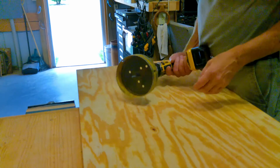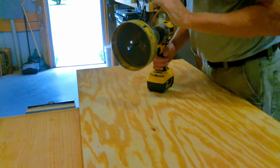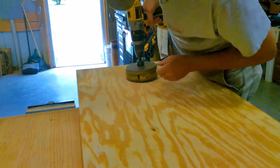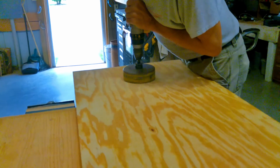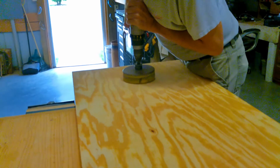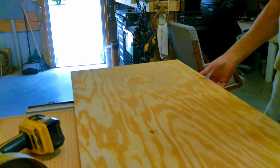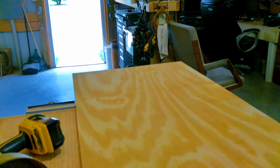All right, so we've got the 6-inch hole saw. Like I said, this could make it very easy. If you ever do use one of these, hold on to it. I'd highly recommend that, because if this gets caught on that wood as it's going through, it will definitely tear you up. So we line that up onto our point, and we start drilling, and make sure you have that thing held on. And once we get halfway through that, because I don't want to rip out the other half either, we'll go ahead and unclamp, spin this over, and we'll clamp it back down on this side.